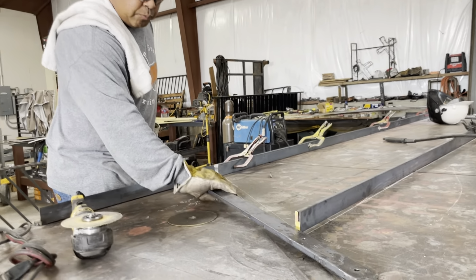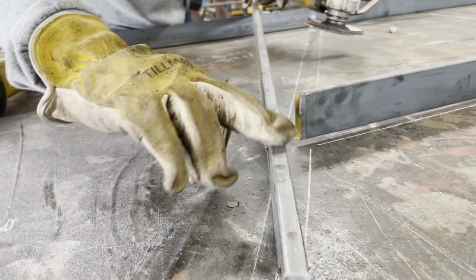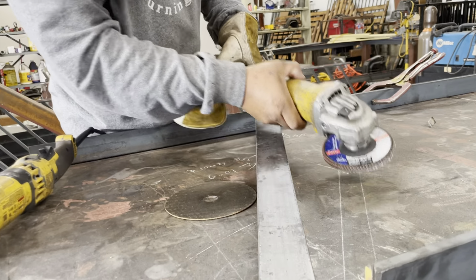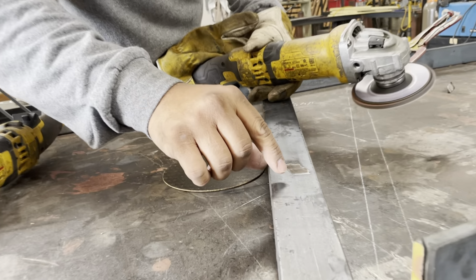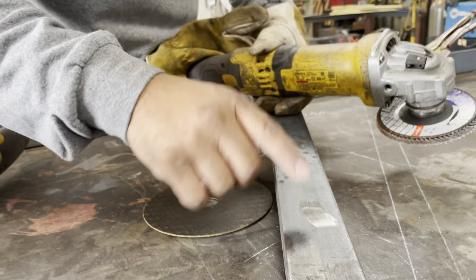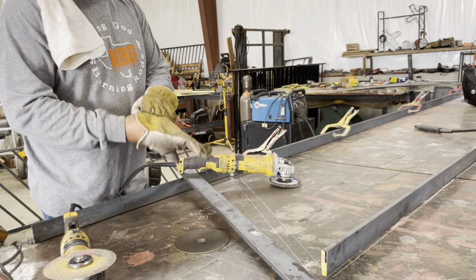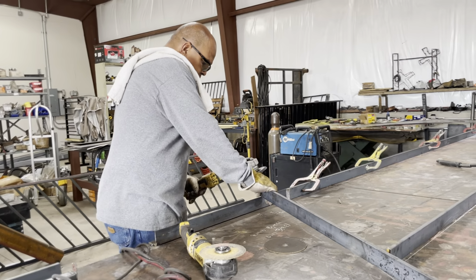if you want to look in, so you see the difference, see where it's that dark gray. If you can kind of feel it, well, here it's not. Sometimes it's a little rough, but you see that dark gray. That dark gray is mill scale. So that's without the mill scale, so that's mill scale. So you don't want to weld on that because you aren't getting true weld on it if you try to go on top of the mill scale. That can prevent a good weld, prevent a good hold.